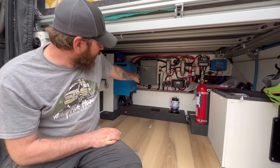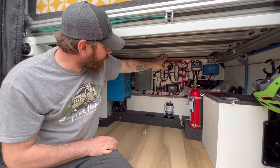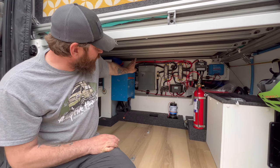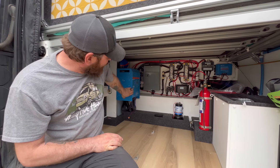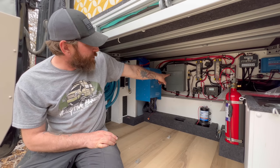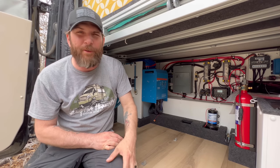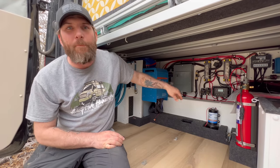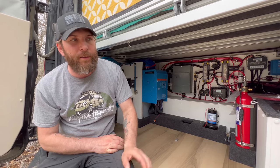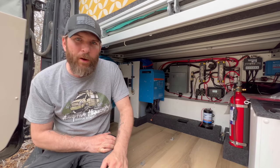In the back there's the main electrical wall divided up — there's a 24-volt system over here, then all your electrical from the battery bank positive and negative, and then the 110 system. The inverter is a Victron 3120, and it also has a Victron shunt so you can monitor actual amperage and voltage being used on every system. Everything back here is 100% marine grade — all fully tinned marine wire.